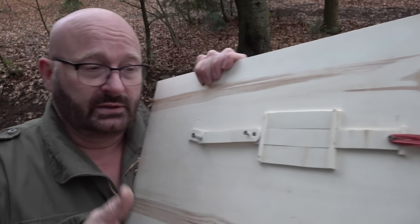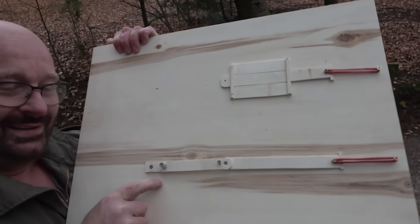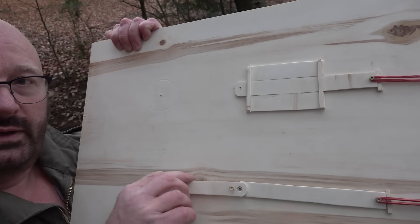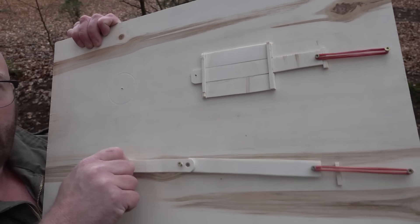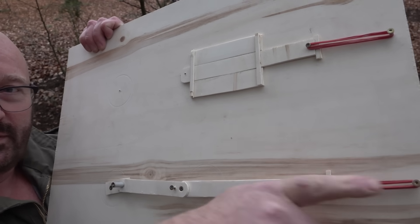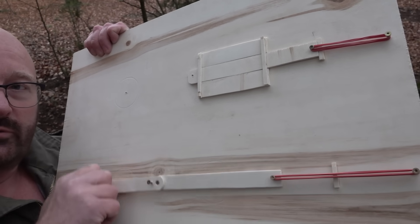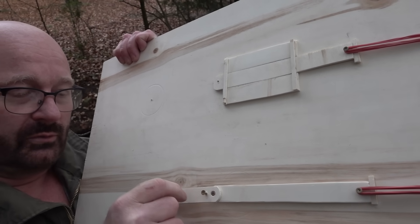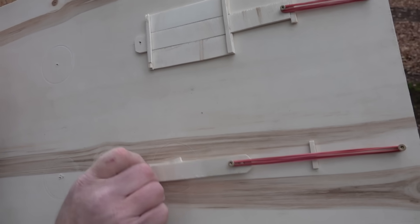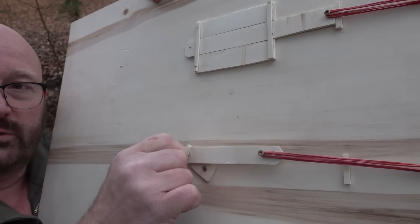Since this is not a combustion engine that needs to be tight, we can simply remove the guides here. Now when I move it up and down, the vector is completely straight and it no longer has to bend. Actually this entire joint is now no longer needed, and now there is no friction eating our precious energy. Of course you can see that this is no longer a straight line from the perspective of the system, but it doesn't matter because the rubber bands are still stretched out in full. In fact, we don't even need this part anymore — we can directly connect it here, making the entire setup a lot shorter. It still elongates the rubber bands the same way without requiring any more force. Everything is a straight vector and nothing is wasted.